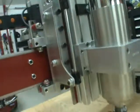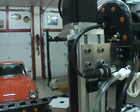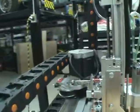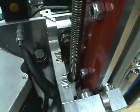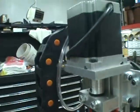I added a gas strut - between the spindle, the water cooling, the stepper, the aluminum, etc., this is a 30-pound strut. It turned out beautiful, nice and simple. There's only about three pounds actually sitting on that ball screw down in there. I didn't like all that weight on the screw - this made it very easy and quick for the motor to run this head as needed.